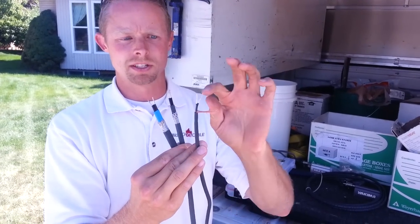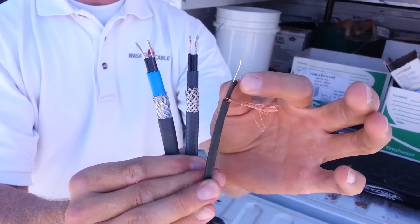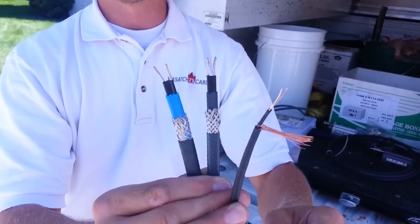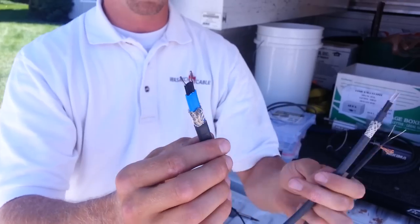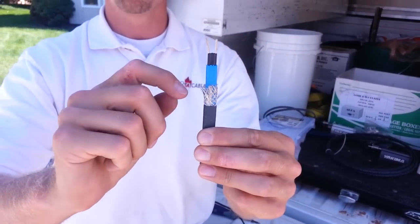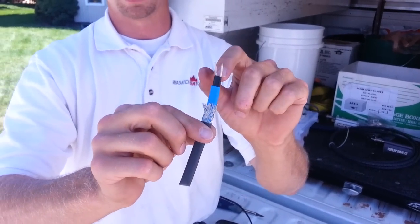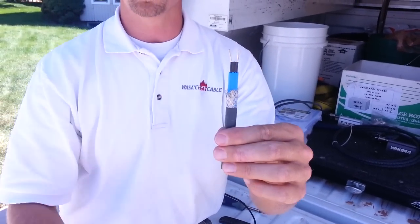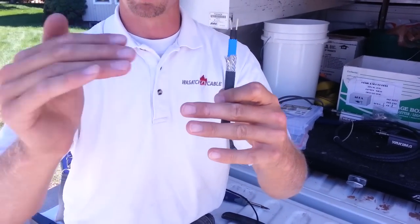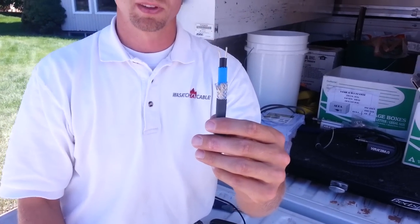Let me tell you a little more about the structure of these cables. The constant wattage heat tape has two bus wires that come out the top, an outer coating that holds the bus wires, a ground braid, and an outer jacket. These just heat up based on power running through them. The self-regulating heat tape — using this Raychem as an example — has a similar structure: an outer jacket, a ground braid, and a barrier of carbon plastic. It's got carbon built into the plastic, so as the temperature gets colder, the carbon in the plastic aligns between the bus wires, allowing electricity to pass back and forth and generating heat. The colder it gets outside, the more the carbon aligns; conversely, as it warms up, the carbon de-aligns and reduces the heat output. That's how these things function.